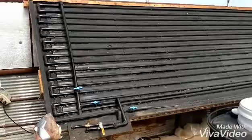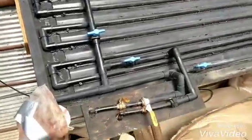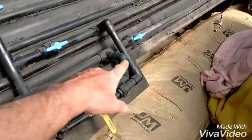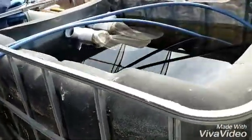The way this is set up, I've got a tank in the back and it pumps water, circulating it through here. I just shut the valves off so the water is just coming through and going right back to the tank. When I open these up, they go over to the heat exchanger, which is in this tank here — that's a hundred-foot coil of half-inch PEX coiled up down in there. The water circulates through there and takes the heat out to heat the fish tanks.